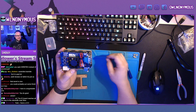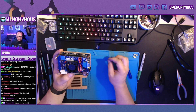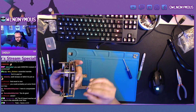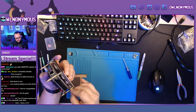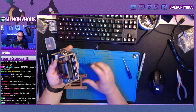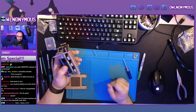It has a small partition — I think it's like eight megabytes or something. You can reformat it and just make it a giant FAT32 or exFAT. I already have an SD card prepared — all we did was use the SD card release tool that is on the MiSTer GitHub setup page, and then ran the updater PC script that you can download and run on Windows.